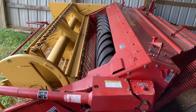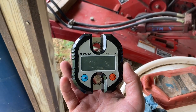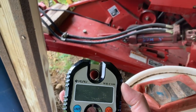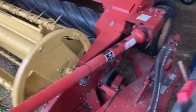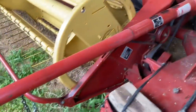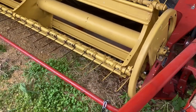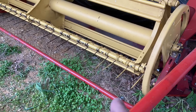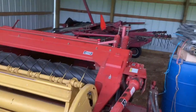There's a way that we can test this. I bought a luggage weight scale off Amazon — it's got little S-hooks that go around each side. To check your spring tension, you need to pull up on the header while the hydraulic cylinder is fully retracted and the haybine is sitting completely on the ground with the full weight of the header resting. You pull up on that and it should require 50 to 70 pounds of lift on each side. The lighter the better — it'll give you more flotation. If you don't have that, you need to tighten those springs.